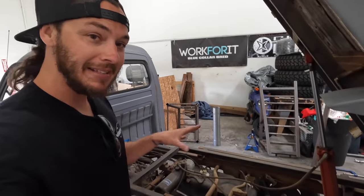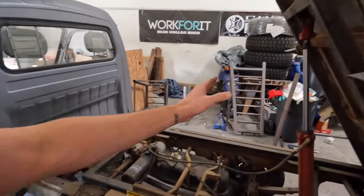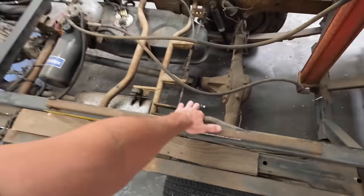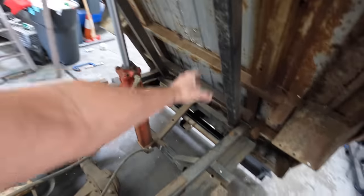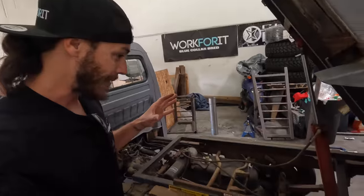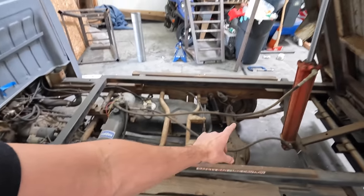And what I think my plan's gonna be, and it's gonna be kind of a pain in the butt, but I don't think it's gonna be that big of a pain in the butt. So when this thing's all the way down, that ram clears this subframe that was built right here, which is what they built the entire dump bed off of. Obviously, we don't wanna mount it to the bed itself or to this framing, because all that's holding this on is those two bolts that are acting like hinges. So we'd be putting a lot of stress on that system if that's what the actual gooseneck hitch was attached to. I would ideally like to attach it to this system right here,